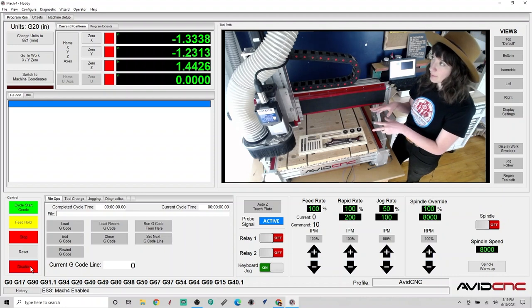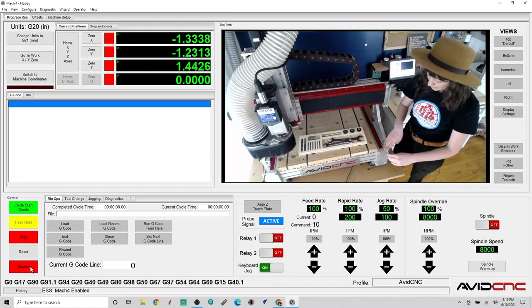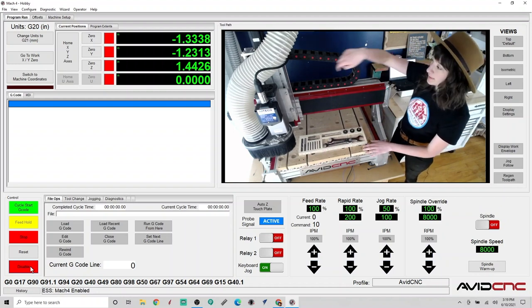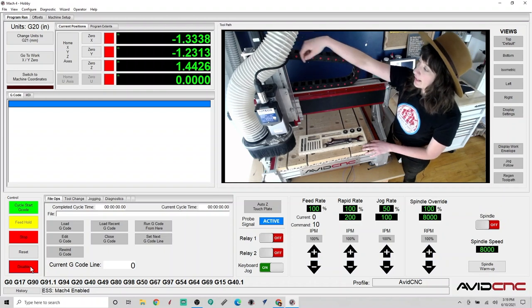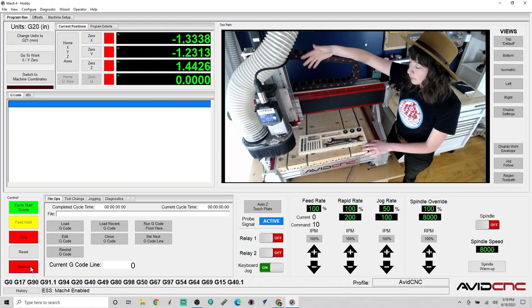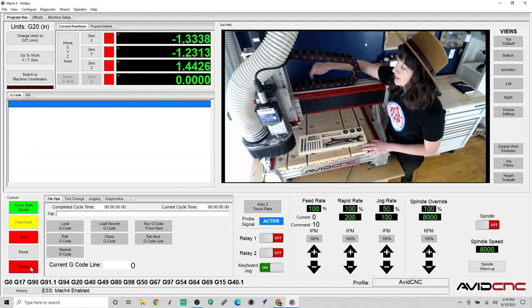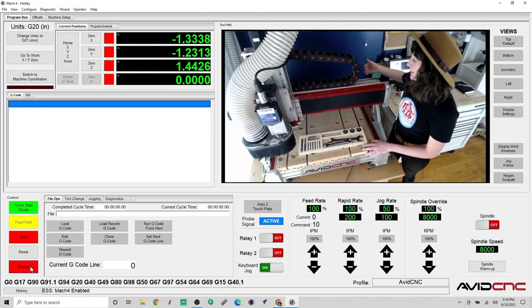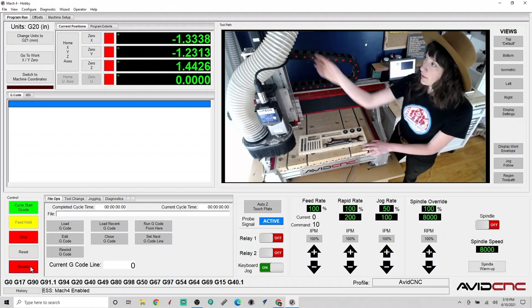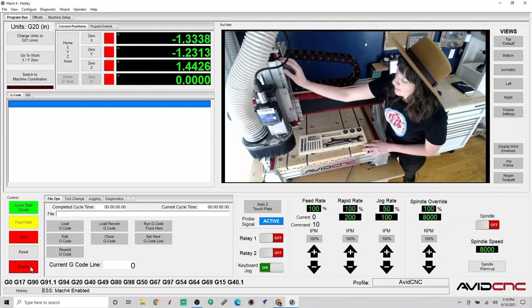This is the Benchtop Pro machine, obviously. So we have the Y1, Y2, this is the X plus, on the other side is X minus. If you have a Pro machine from the last year or year and a half, there is only one X sensor, which will go on the Z gantry here on the back and then detect the X sensor flags there. We also have the Z axis sensor here, and that will detect this metal plate as well.